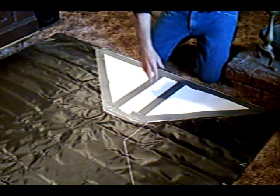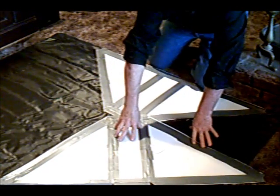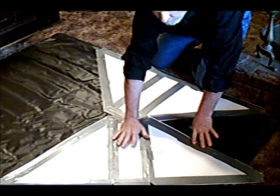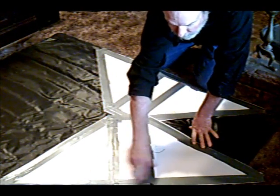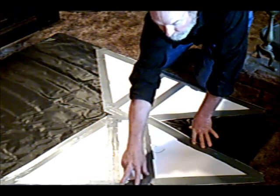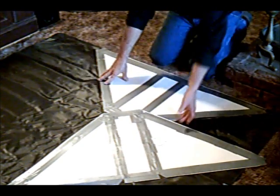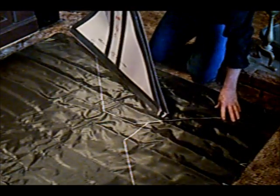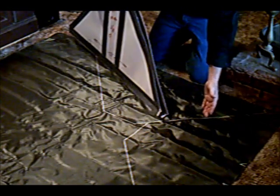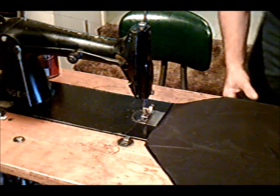I have the patterns laid out. I'm going to show you this pattern right here — this is the top. You notice there's a little notch here, and this is a tab. This is how you attach it to the top rail in the hovercraft, this here being the bottom. What I've done is I've just traced these out onto the fabric, keeping the pattern as tight as possible so that when you cut it out, you have as little waste as possible.